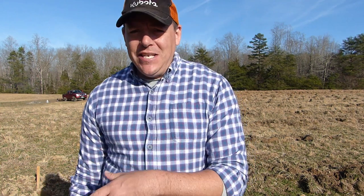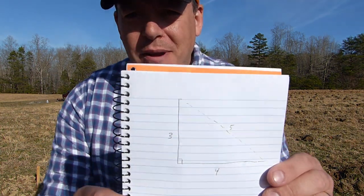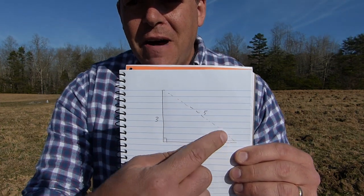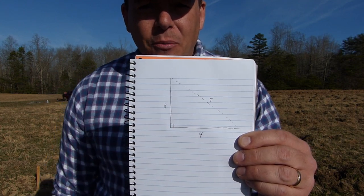In order to do that at this scale, I know from woodworking the 3-4-5 rule. Think back to your high school geometry class — that's based on the Pythagorean theorem: a squared plus b squared equals c squared. But really all you need to know is 3-4-5, and that number can scale to whatever you want. If you have three on one side, four on the other, and five connecting the ends of those two points, that will guarantee that you have a right angle where those corners meet.